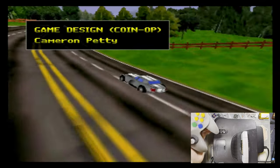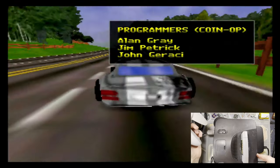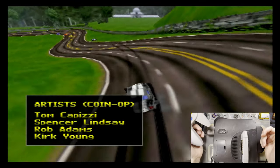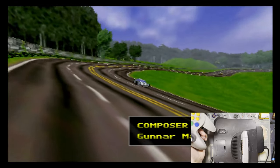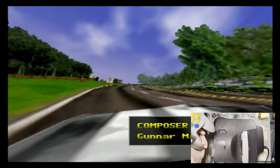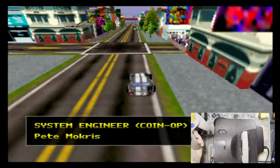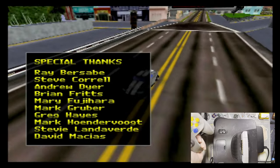It definitely has more features. I think the Ultra HDMI, aside from having component out support, I believe it also does up to 1080i, whereas this thing only does 720p. For something like an N64 where some of your footage is already going to be interlaced, I suppose having 1080i is actually a pretty decent thing.